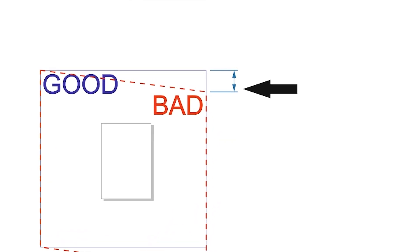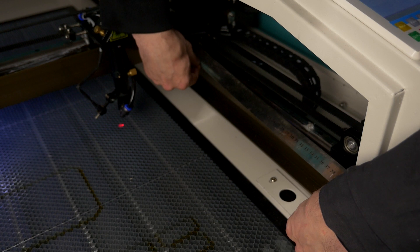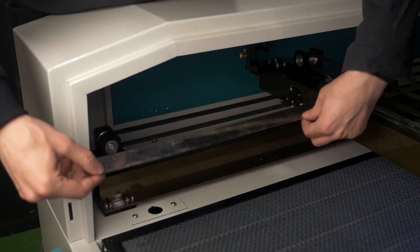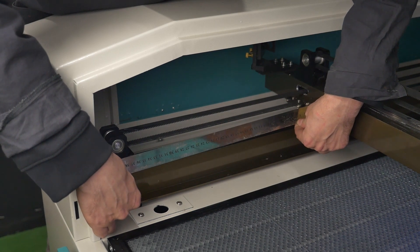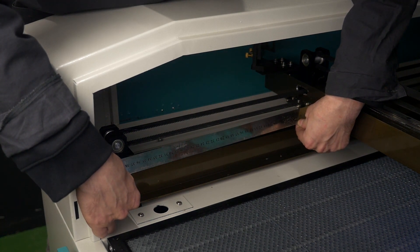Your task is to adjust the position of one of the sides of the gantry to this distance. Before the adjustment, position the gantry anywhere on the work table and measure the distance between the gantry and a stationary mechanical part of the machine — first on the right side, then on the left side. Write down the resulting values.